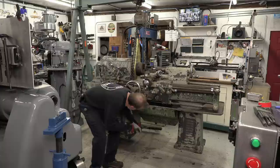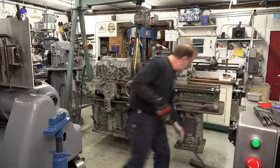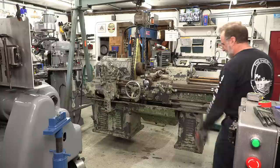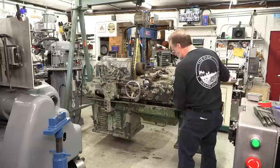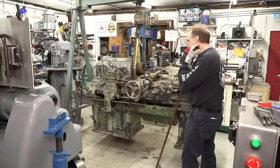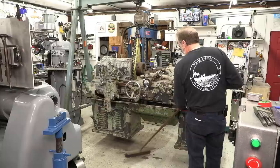I was thinking whether I was going to put her on cardboard or something else, because I know we're going to have a lot of things around here, but I think the sweepable bare floor will be fine. Speaking of flooring, you can see that this coating here that I put on there was a little bit darker than this right here. I think this was like a second coat coming on over. A couple areas did peel up because it was severely soaked with oil in different areas. This was an automotive shop. But also, I rolled in with heavy machinery and dragged machinery across here as well. So some areas did peel up. This right here was just because it was saturated with oil and it wasn't going to get a good bond.